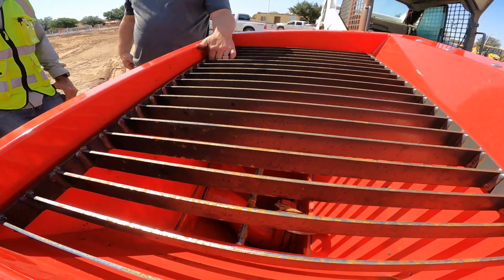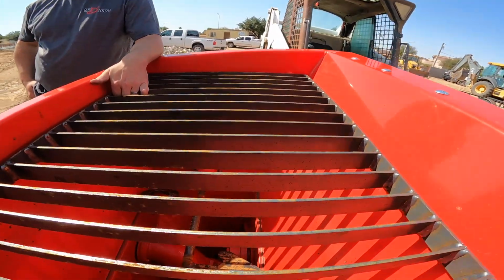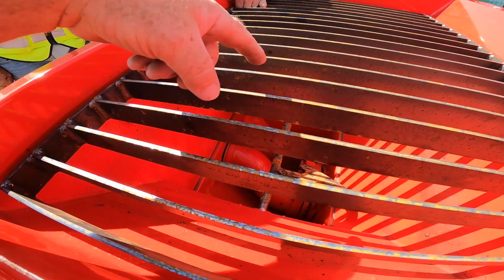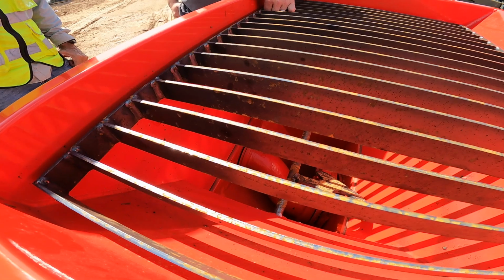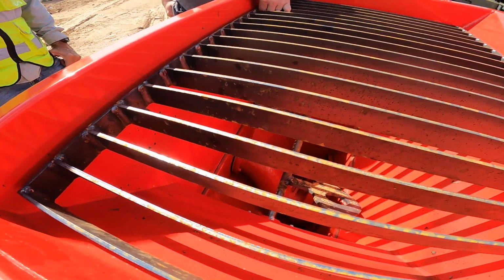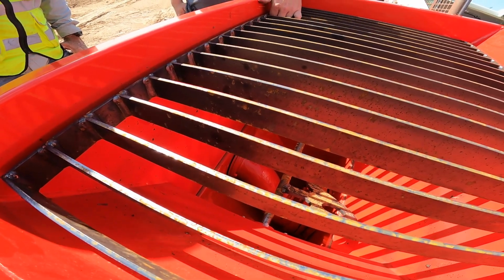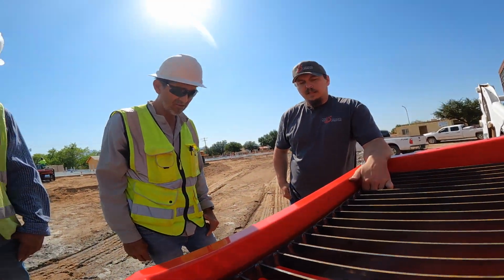There are 4 key points of washing this hopper out that you want to make sure you get clean: either end of that valve, and then this agitator. On either end of this agitator, make sure you get that sprayed out good before you grease it. Once you get it cleaned out, then grease it. That ensures by getting that grease in there that you push out the grout that might have still been in there.